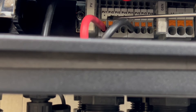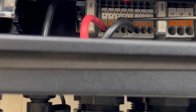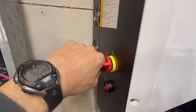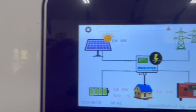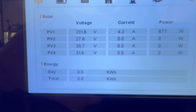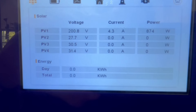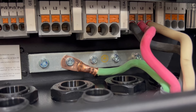I just installed the solar. All the positives are on the left, negatives on the right, and again there's four strings. PV1 positive and PV1 negative. Let's switch the PV on. We've got 0.8 kilowatts coming in. It'll show voltage — we've got 4.3 amps coming in, just at 874 watts. The sun is just coming up on that side of the array.